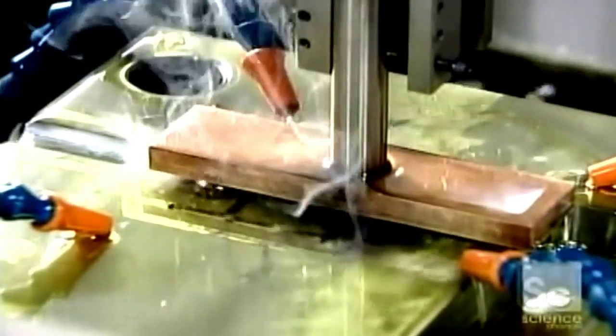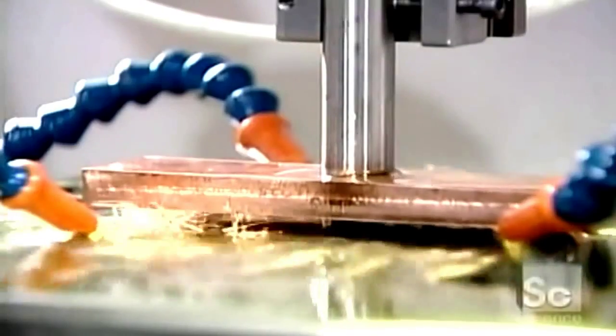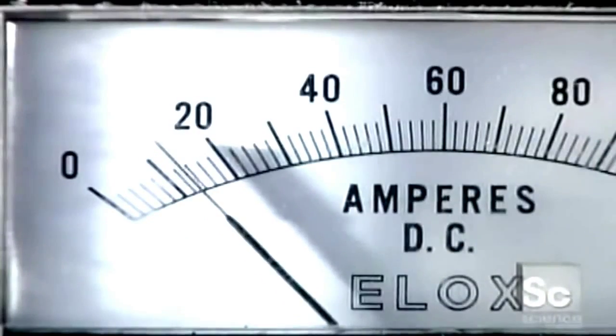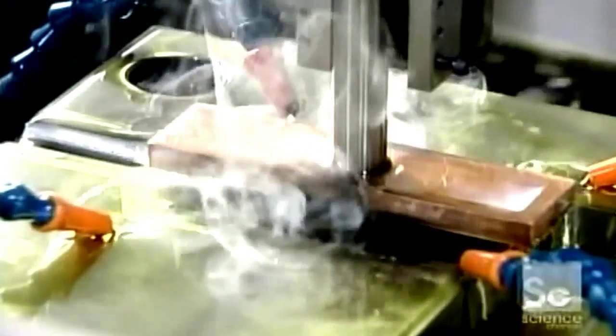The electrode goes face down on the second tooling machine called the EDM. Directly underneath is the mold half that's been partially formed on the first machine. A strong electric current runs through the electrode and penetrates the mold, forming a cavity in the shape of the electrode.